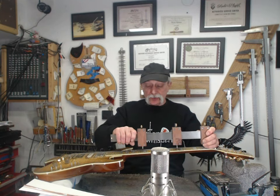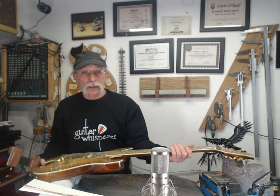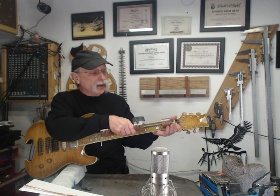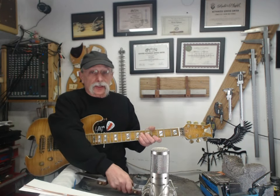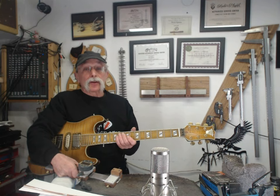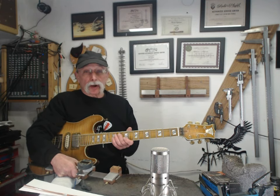I like mine because I can position it on the first, fifth, and twelfth fret of any guitar — any fretboard from a mandolin to a bass. But you can't measure the relief when the guitar is on the workbench, because the weight of the guitar will change the bow of the neck. You want to measure the relief in playing position, and you want to set that relief typically to five or six thousandths on the low E, and typically three or four thousandths on the high E. Lower actions will have straighter necks with less relief, and higher actions will have more relief.